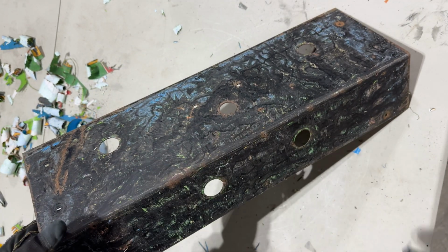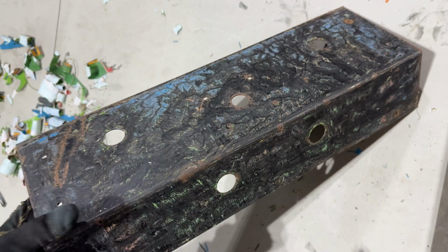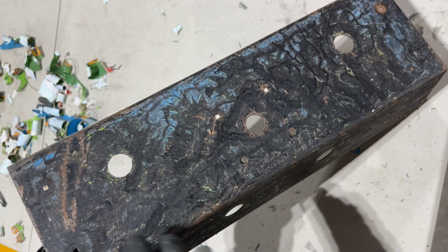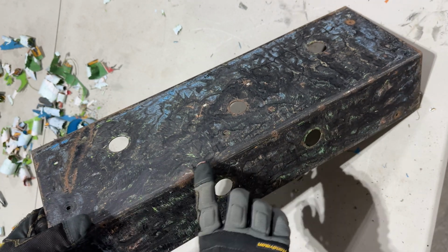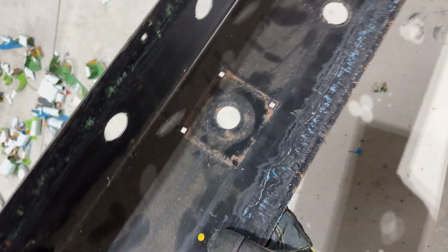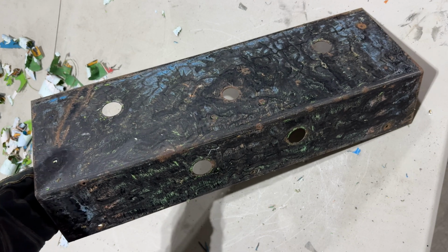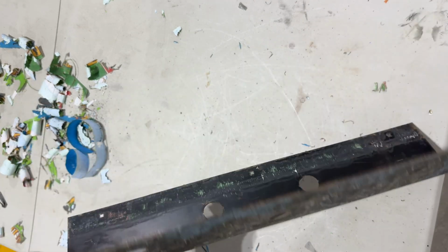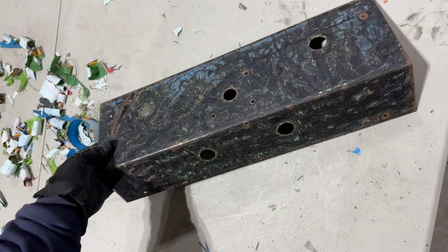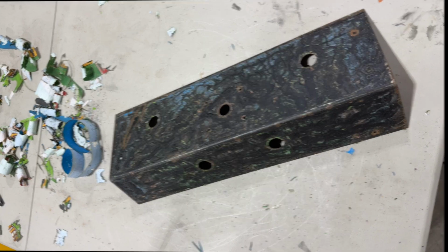Like I said, next step, I'll do this off camera. I'll wipe this all down with acetone to get the remnants of the glue off. And then I'll take my wire wheel to it, lightly go over any place I see a little bit of rust, in the bend here, around most of the screw holes, around where the joystick mounts in the center there, to get that all nice and good. And then I'll hit it also with a coat or two of white spray paint, let that all dry, and maybe hit the back with a coat of black just to prevent rust. And then we'll be ready to put the reproduction control panel overlay on this thing.